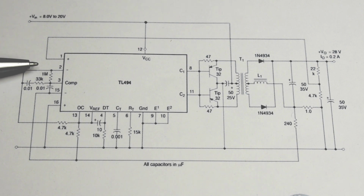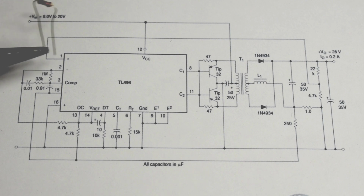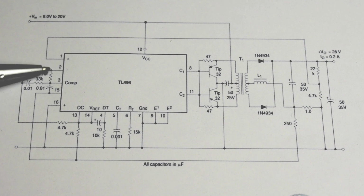So pin 2, you can see there's a resistor right here, and another resistor next to it. What I did is I located the resistors inside the power supply unit that I have, and with the power on, I took a 10K resistor and placed it in parallel with the soldered points for the resistor. When I did that, I looked at the front display to see if there was any change in the output voltage. If there was none, I went on to the next one, which is right over here. And when I did that one, the display changed.